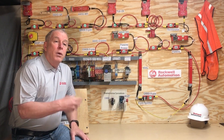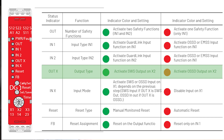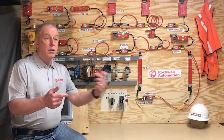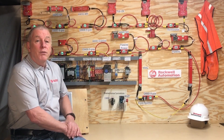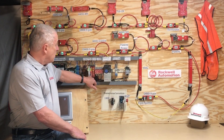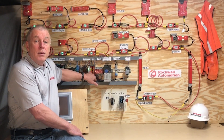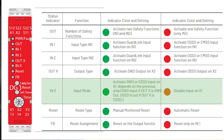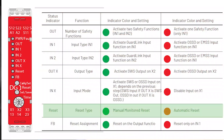The next indicator is OutX. The DG relay has a single channel input and a single channel output. We can configure that input and output to be either OSSD type or single wire safety — so I can get single wire safety in, single wire safety out, OSSD in, or OSSD out. Right now, the OutX terminal is configured for single wire safety, connected to an EM expansion module. The ENX LED is red, telling me I'm not using the ENX terminal. The reset indicator is red, meaning it's automatic reset, but I can change it to monitored manual reset, which would make that LED green.